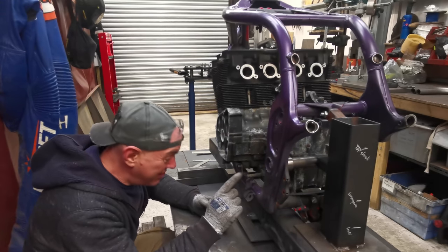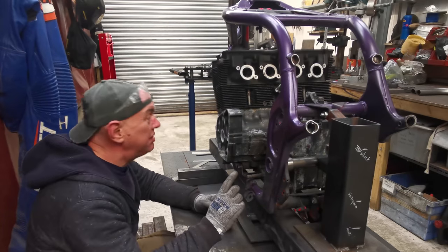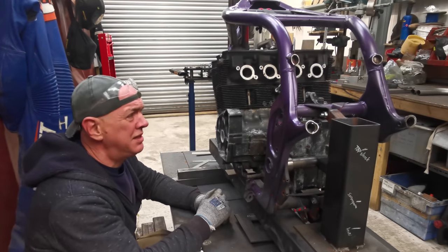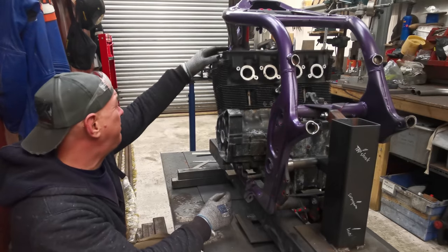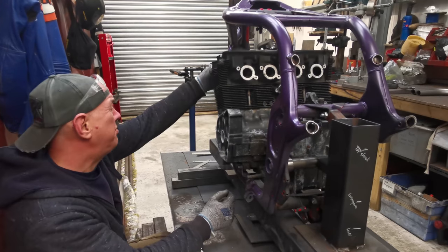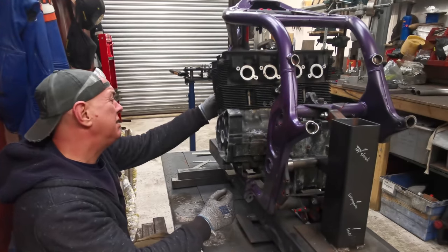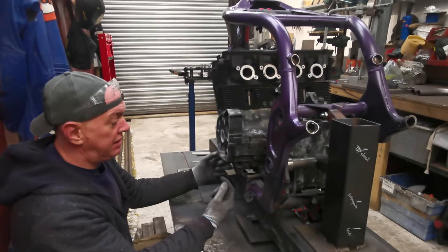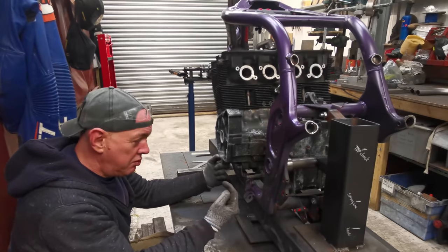Right, there is bugger all room. There is nothing. And we are using slightly wider tube. The stuff I've got is 1.5 inches, so basically it's the same as this. This stuff down here, and at the front, that's all skinnier. Don't like that, I want it all the same. So, some of the changes is going to be where it comes down the front here and then down between the exhaust ports, and then we get this little nudge out. I'm probably going to have it continue down, because there is a bracing bar that goes across the front there anyway, so that's fine, but we're probably going to come down to where the engine mount is, and then we're going to kick it out here, so move that kink down a little bit. And then we're going to pull it out this way a little bit more.